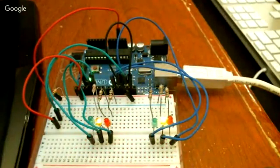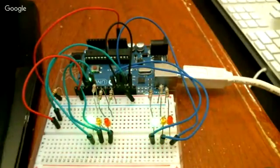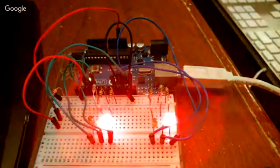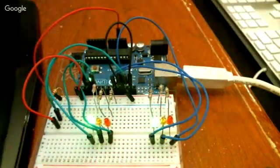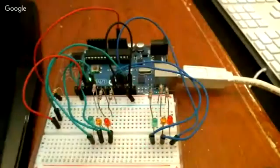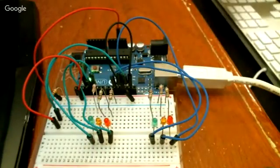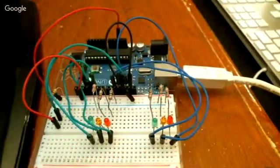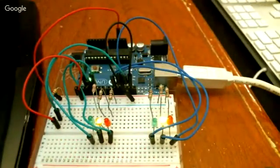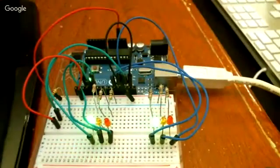Yep. I mean, you can write yourself, obviously using a Flask template, a little interface that could even send post messages back to that. It's running a server. Send a post message back and have it do actions. You could actually hit a button on your web browser remotely and trigger some pin on that board to do something, like put your garage door up or something like that.